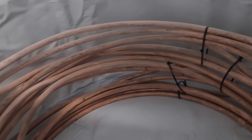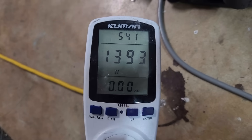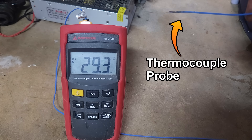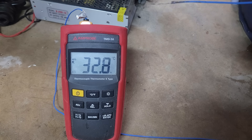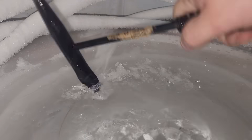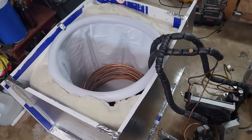Now pulling real power, the coils started freezing up within moments of turning on the system. I load-tested by adding 15 gallons of water from a garden hose. Within about 20 minutes ice was building up on the coils, and after about two hours there was a pretty good-sized frozen donut in the tub. The system reached a steady state of about 1,400 watts, with pressures at about 210 and 30 psi (15.5 and 3.1 bar absolute) on the condenser and evaporator respectively. The heat output was remarkable — just walking into the garage I could feel the heat coming off the condensers. At 24 hours practically the entire thing was frozen over, even with no insulation on the tub at all.